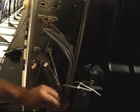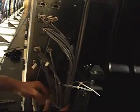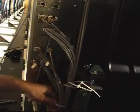If you don't have tension pulling down on all your terminal wires and pins, then sometimes when you get shorts in the system you can't find them. That's where you've got to look. And this just helps you avoid having to look for those problems in those areas, as long as you get to it quick enough, especially in a new installation.